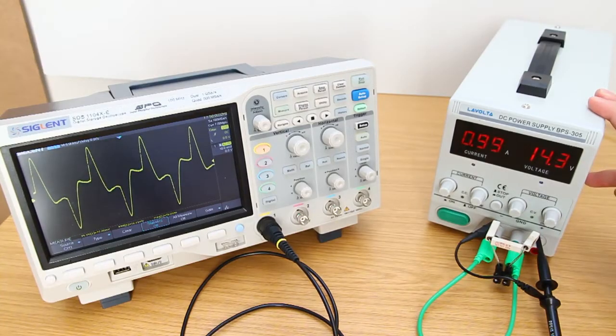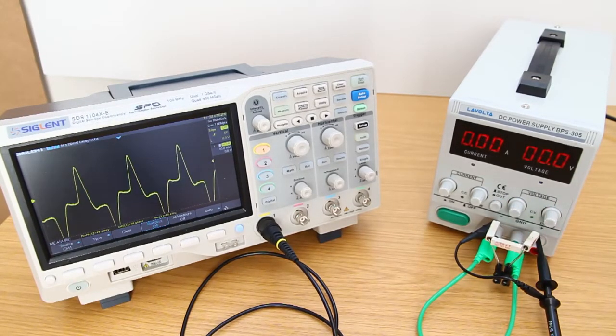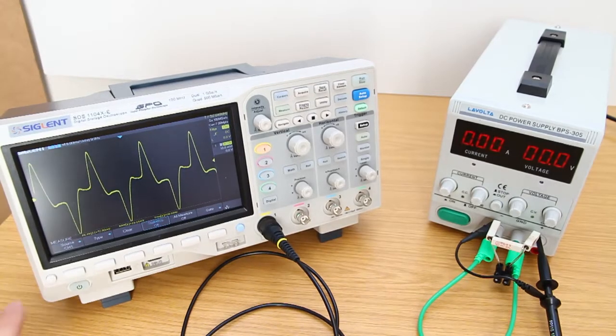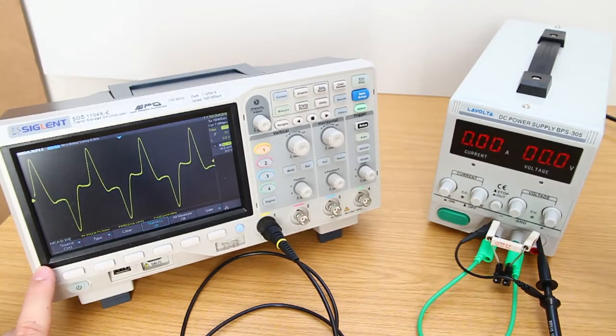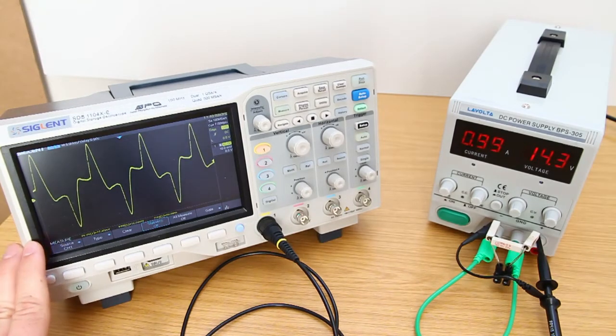As you may have also noticed, this signal looks a bit suspicious. I don't think most of it is actual ripple from the voltage regulation — it's probably mains hum introduced inside the power supply to the output signal. I've found a few clues as to what might be going on. Watch what happens when I turn off the output: the signal is still there. How can that be? If the output is disabled and this isn't coming from the voltage regulation, that must mean this part of the signal comes from another source.